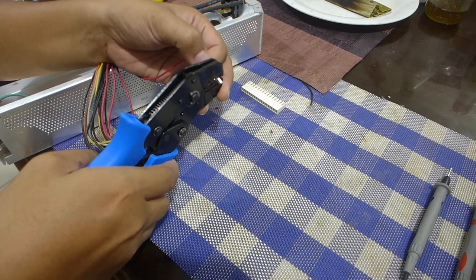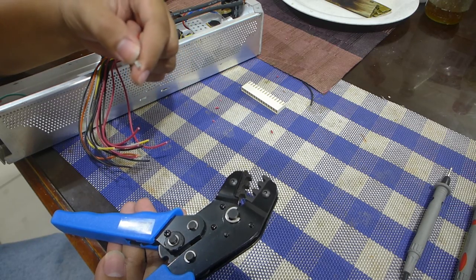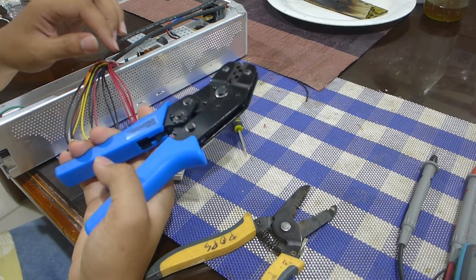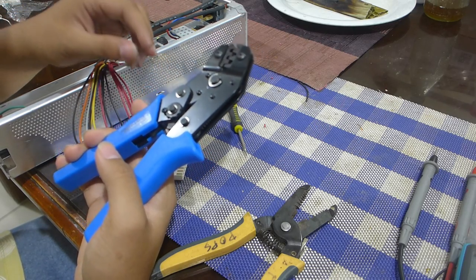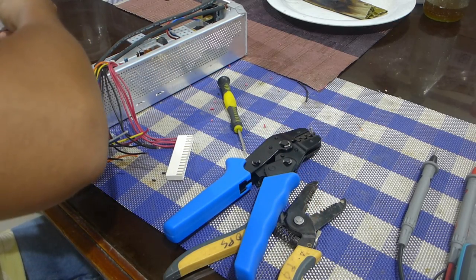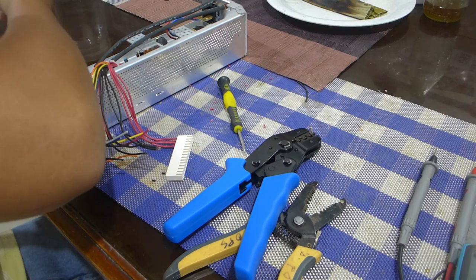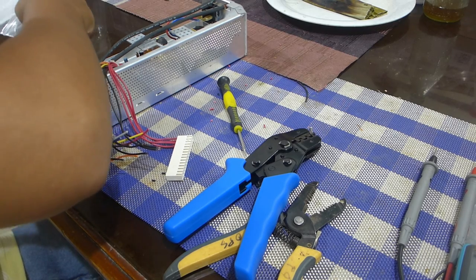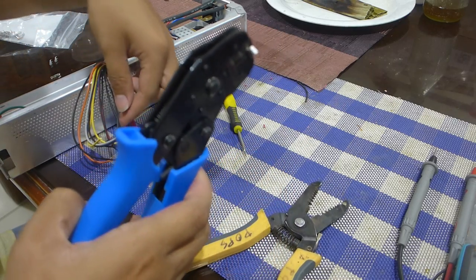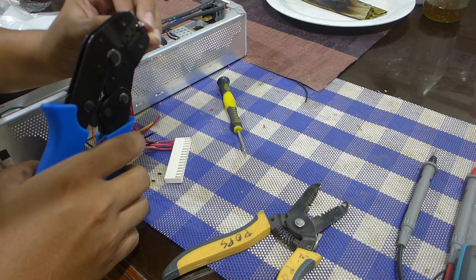To be a decent contact. That turned out nicely. Well, turns out I'm supposed to be using the 0.5mm size rather than the 1mm size, because it resulted in pretty fat crimps that would not fit in the housing properly, unless I correct it with a pair of pliers. Well, since this is just for low voltage, since this is just 5 volt stuff, I don't think it's too important. So, let me start crimping the ground wire, or at least just crimp one of the ground wires, because it's really, really tedious to crimp these right.